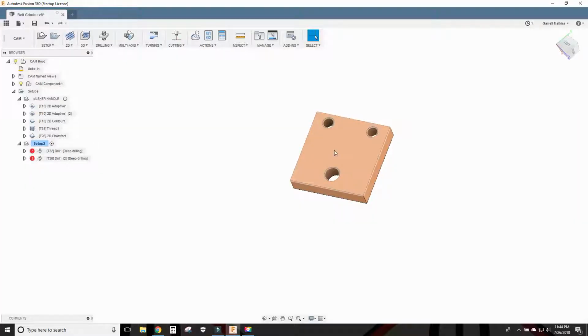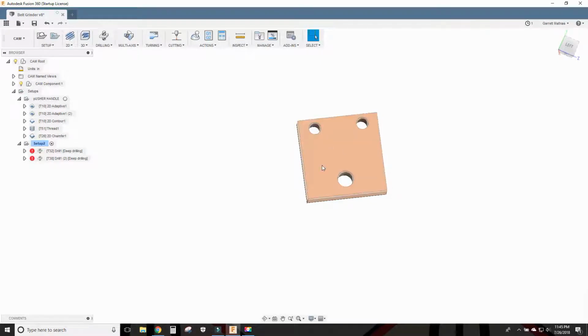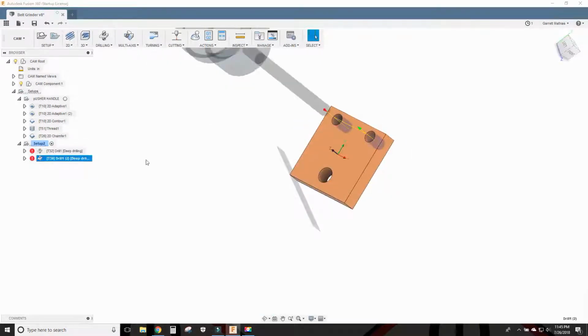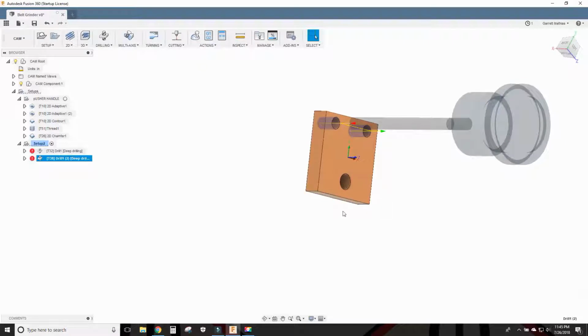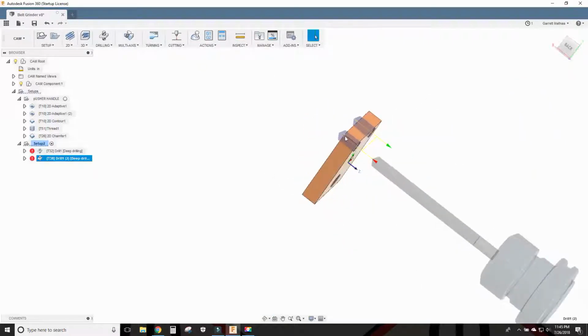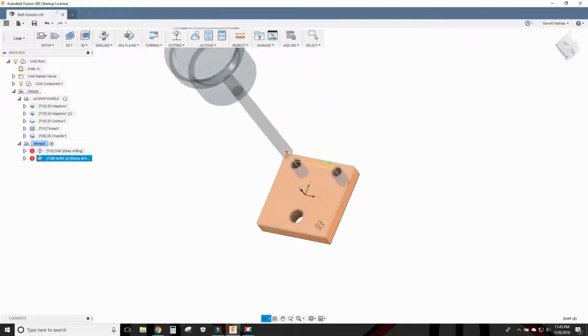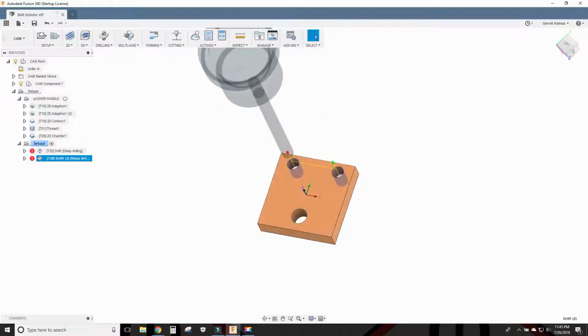And this tracking wheel mount is even easier than the handle. Literally all we're going to do is take this thing to size on the outside and then drill holes. That's it. Super duper simple. And I just manualed it around the outside to get it to size. This is 2.5 by 2.5 inches, and it's 1/2 inch thick. So this is some of the most simple parts that I've done in a while.